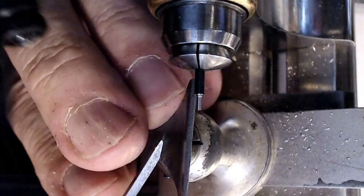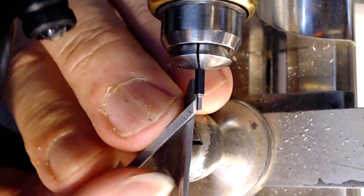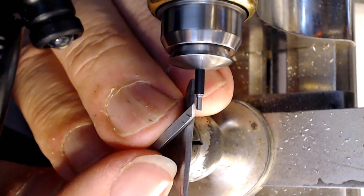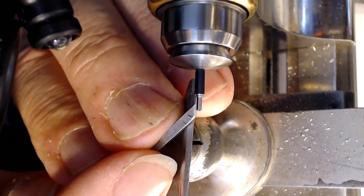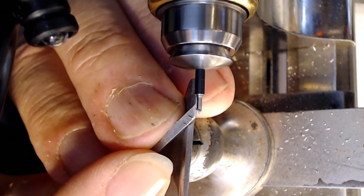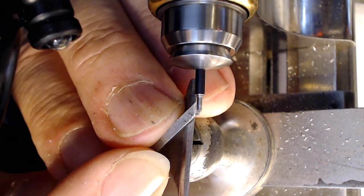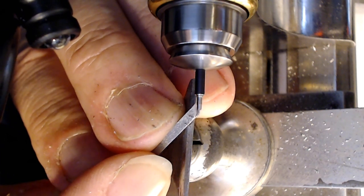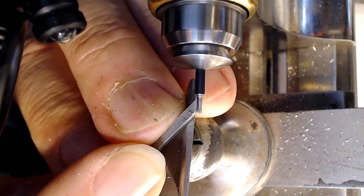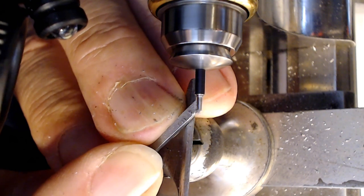And again, the best thing to do here is to start on the end here and then work your way up, because you'll just be able to put the hairspring on and ride it up. I'm going to just take some material away on this side here. Scraper is pretty good, it's fairly sharp. And again, I can see the angle here, a 3-degree angle.